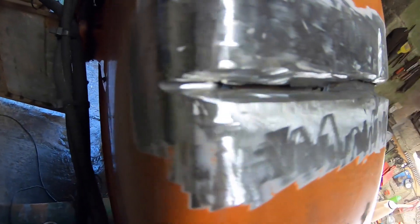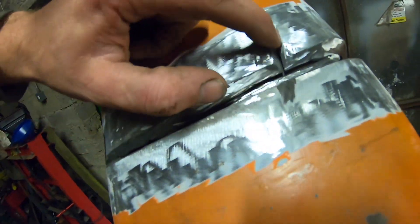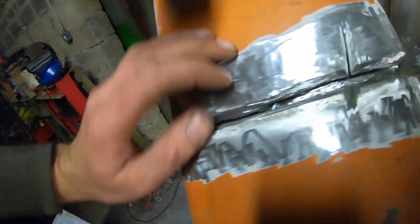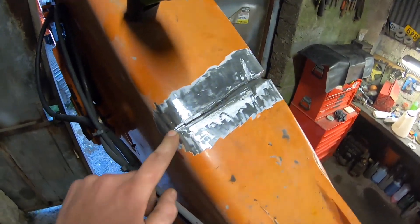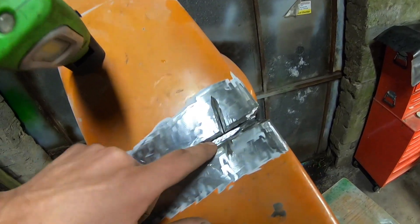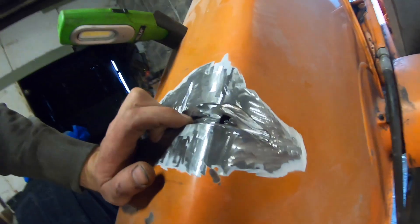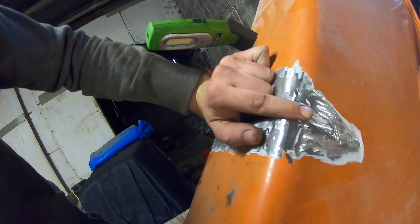That took a little bit longer than I expected and I had to take out quite a bit more than I thought. But I think I've got everything out now. There's a lot of hairline cracks in here — hairline cracks everywhere. It was going too far and I was going to end up taking out too much, so I pretty much cut another V that way and after that one that way as well — it's a good stitch, it'll do no harm. This was the weak side; the same side seems to be fine, no sign of crack at all there. The crack kind of stopped here and I just went a little bit further to make sure. It's so wide here now because there were literally cracks throughout everywhere — every time you cut you could see little lanes running up through the metal. So I had to cut them all out. I'm happy enough now. It's a very wide gap — probably about 15mm at the top and 10mm here where it widens out.